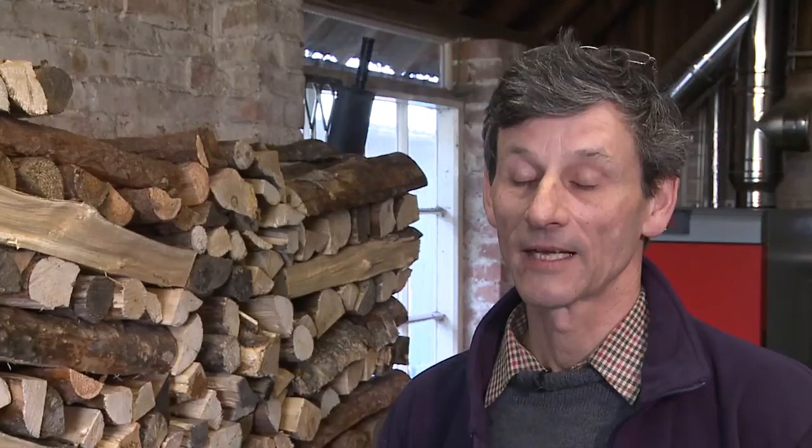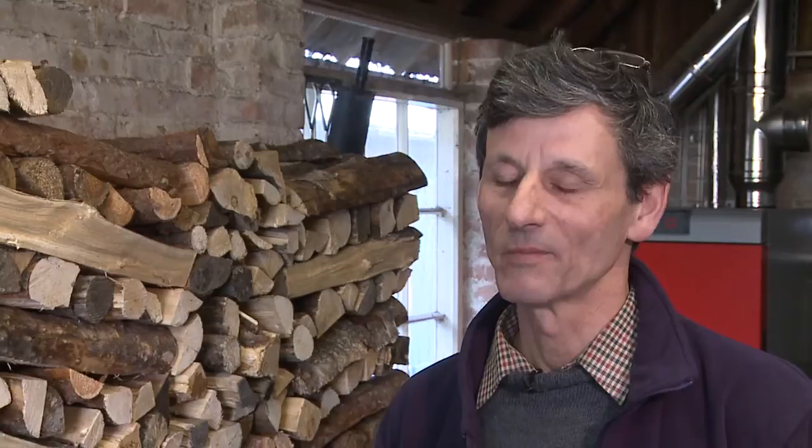In terms of types and species of wood, this boiler is incredibly forgiving. It really doesn't mind whether it's hardwood or softwood. We've had instances where we've done a softwood thinning and there's been deadwood which I can't sell into the normal markets - I just take it home and it goes through the boiler. The one thing you can't put through it is any sort of treated wood. You really shouldn't put MDF, chipboard, or any man-made fibre boards in - the gases given off are highly corrosive and will damage the boiler and flue. And it's not very good for the environment either.